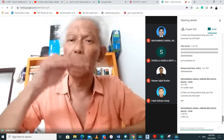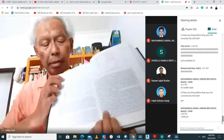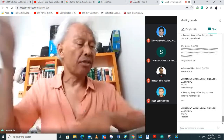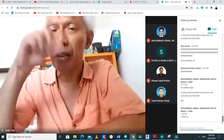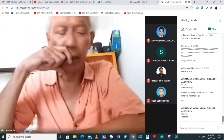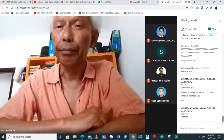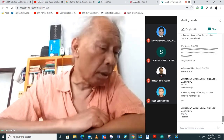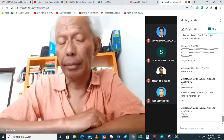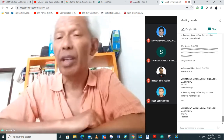So you see that increment of steps in the picture here, increment of step constant. So that's what is meant by maintained load. All right, so that's just load against time. And the dial gauges at the corner are going to measure my settlement. So these gauges will give me the settlement. So in the same picture, in the maintained load test, I have the settlement against time. Then I can obviously draw that load against settlement.